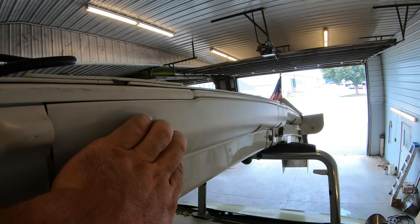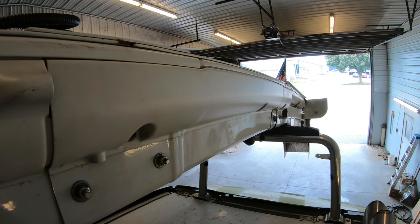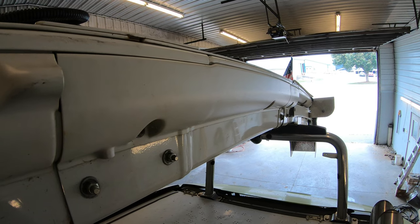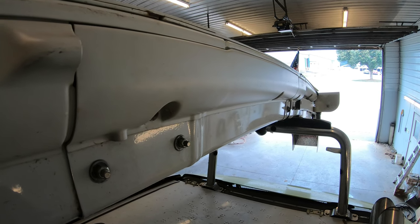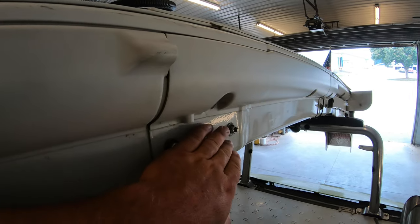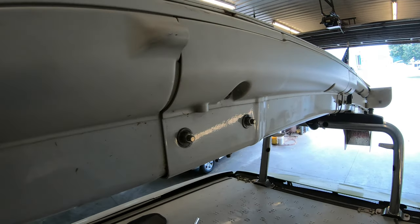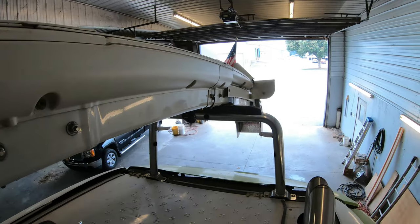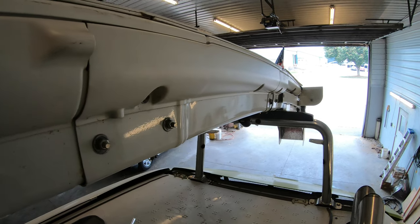All right, I'm gonna get started. I'm up here on top of the harvester. The first step is to take these covers off where the hydraulic lines and the cord for the camera are stored. I remove the covers, unhook the cord, and then take the hydraulic lines apart before I take the spout apart. There's several bolts that hold the spout together. So I'll take them out and remove the end section once everything's taken apart, and then we'll slide the extension in place and bolt it fast. All right, I'm gonna catch some of this on video and get started here.